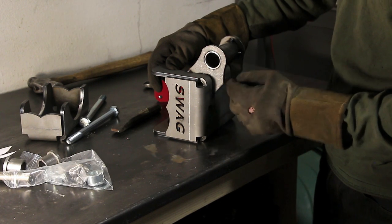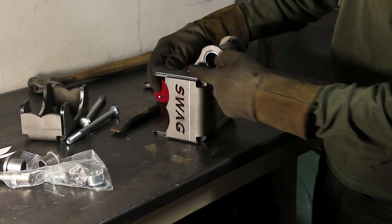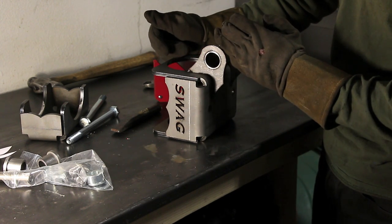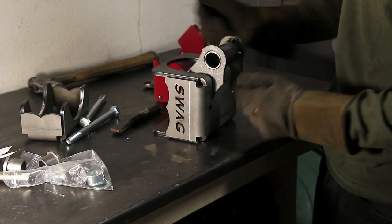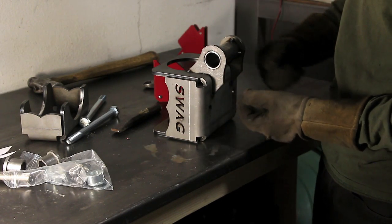And if it didn't have this tube, I would certainly tack this piece more on both sides, because if you lay a big hot bead here with only these two end tacks, it's going to contract and suck towards the weld. But with this tube, I think we have enough stability to weld this however we want without it pulling one way or another, as long as we have it adequately tacked.